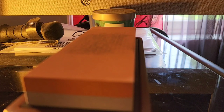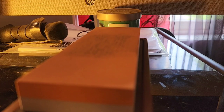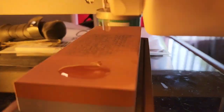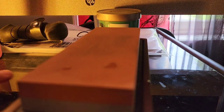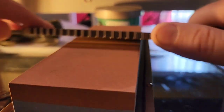That's a small knife, and I'm not going to show you the entire process on a big knife because we'd be here forever. But I'll use the honing side because I've been using this one a lot — this is my own design, the D-Bad Military Combat Knife. I'm going to throw a little bit of oil on there. It's the same thing — I'm going to go all the way. This one has a round tip, so I'm going to follow that round tip. When it gets to the tip, you want to just lift up on that heel a little bit so you can get all the way through.